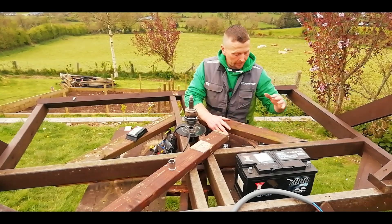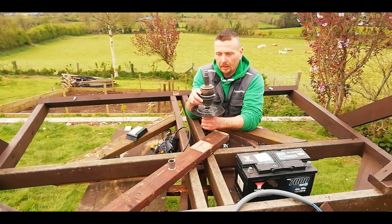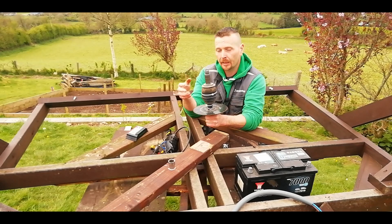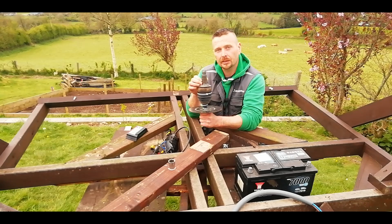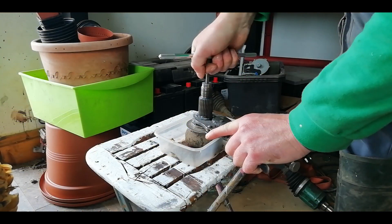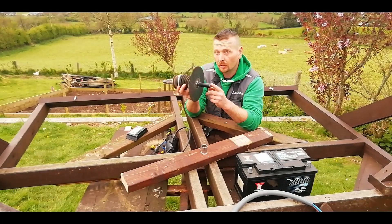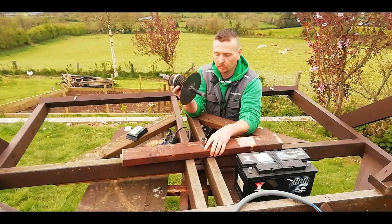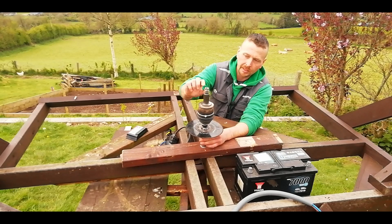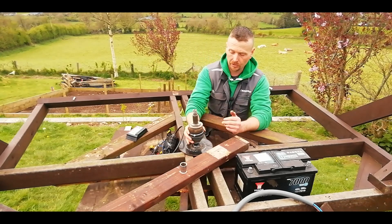Here's where I'm at so far: the frame is cut down to bring it out of the wind, the drive shaft is cut to size, and the sprocket is welded on. This is a front drive shaft out of one of our Subarus, and the bearing it sits on is a rear bearing — luckily the spline count and thickness are exactly the same size so they fit perfectly together. The only difference is the length; I drilled the hole and tapped it to take a bolt to secure it in place. I didn't have a bearing for the lower end of the shaft so I'm using a 22mm socket — being a mechanic I've loads of spare ones — it's a nice sliding fit that'll keep everything steady once the top end is secured. I'll pack it full of CV grease to keep it running smooth.